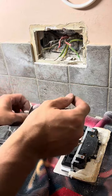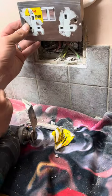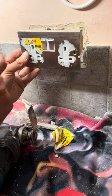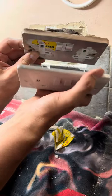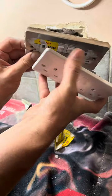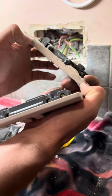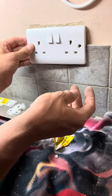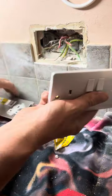This is the only way I can see to do it, because whoever did this grouted in the top of the socket. They should have sunk the socket in properly, or brought it lower and cut around the socket below. It's slap bang in the middle — obviously a DIY job — and then they grouted over the top. So I can't just put a new socket back because there'd be a gap all around the top. You could use white PVC spacers and cut the top half off, but the kitchen is going to get redone anyway. So I suggested cutting the tile out fully so we can place the socket back properly in the wall, and they're happy with that.